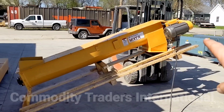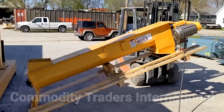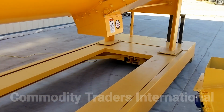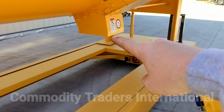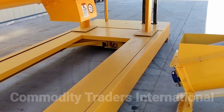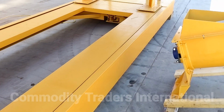The length of the screw conveyor is 8 feet. We have a more in-depth video just on the screw conveyor on our channel. See the description box below for a link to that video. Moving on to the mixer, the discharge height of the rack and pinion gate is 36 inches from the bottom of the spout there to the bottom of the yellow channel iron there. We have the unit setting on 6x6s for ease of movement. The discharge height is 36 inches from there to the bottom of the channels.